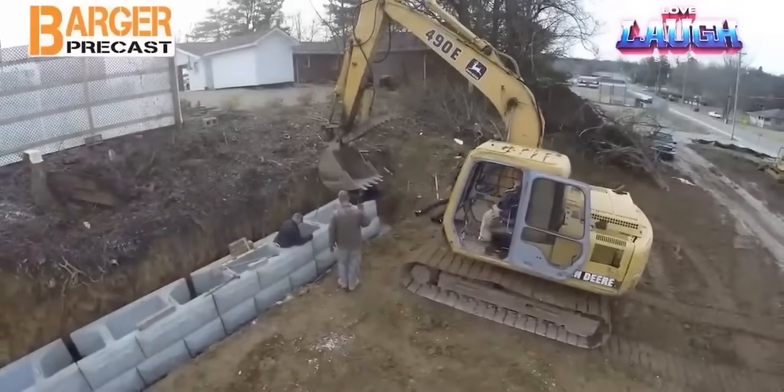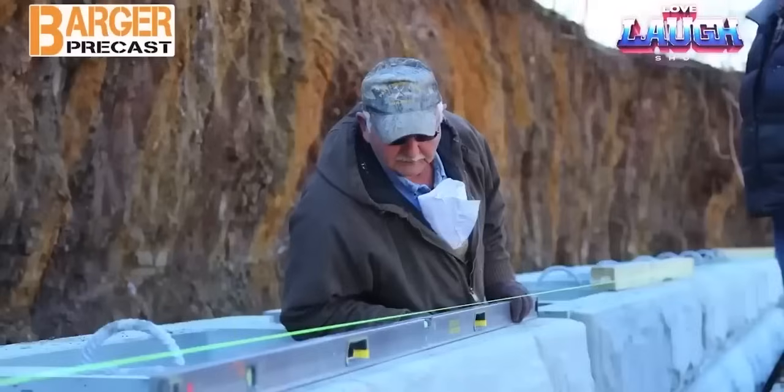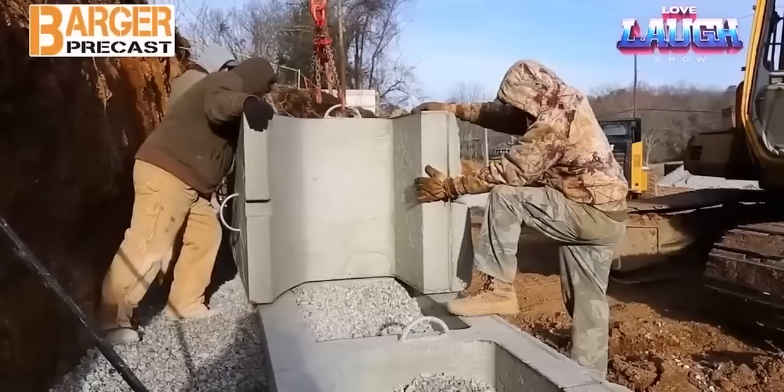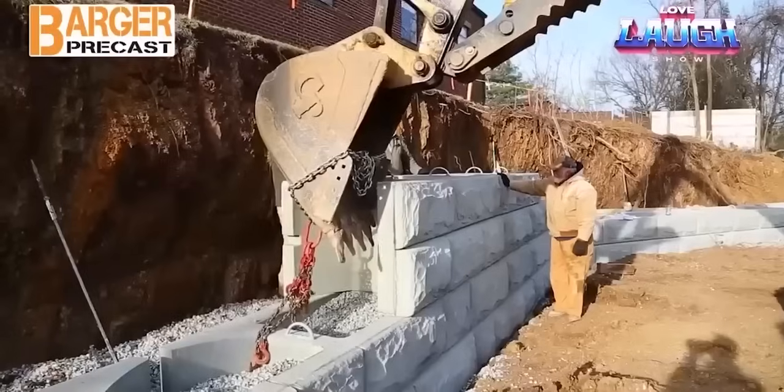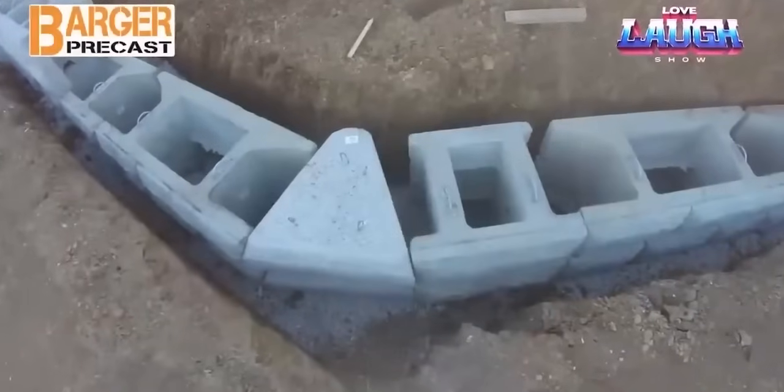Gravel is suitable for filling. If there is no gravel, earth will do. It is stated that if the wall is built without ground anchors and geogrid, in the case of Stone-strong, it can be made higher than from competitors' blocks. And Stone-strong is recommended for everything from anchoring banks to widening of roadways.